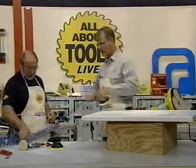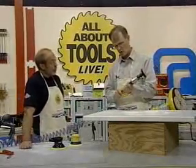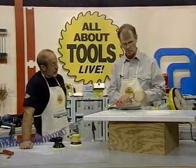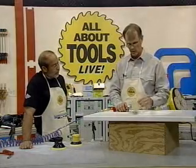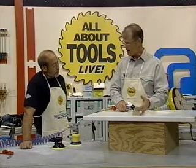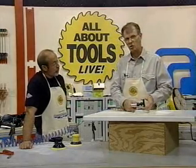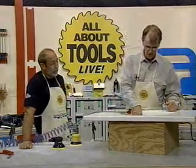A couple of years ago, we got two manufacturers together — John at Beaver Tools, who has a small random orbital sander with an offset head so it's very comfortable to operate, and Danny Holmrich of Danny Designs, who is the creator of the radius pad. By getting the two of them together, they made a radius pad that allows the paper, as you can see, to roll up on the edges. You can easily accommodate anything to comfortably, maybe a quarter of an inch radius with a little bit of pressure, so it easily handles this bowl.